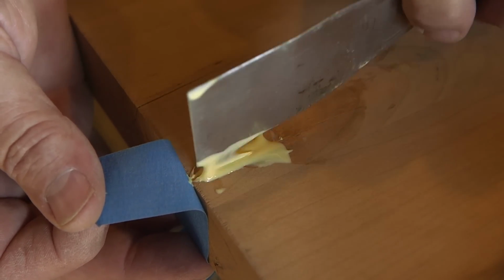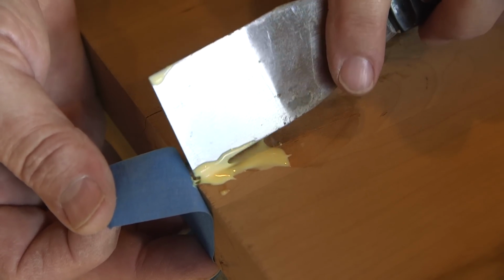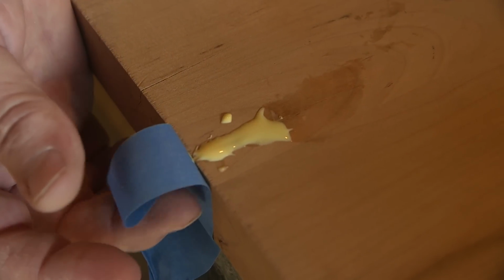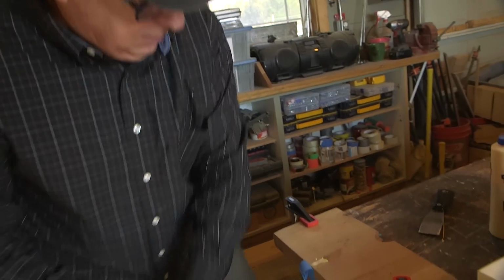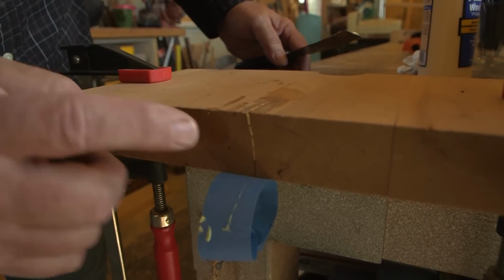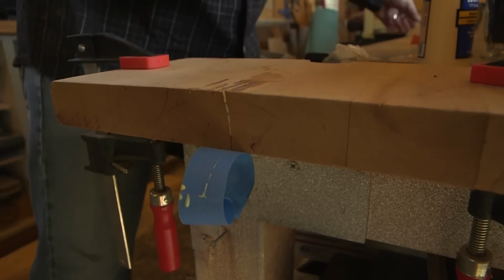And viscosity of the glue matters a lot. So this is actually an autumn day. The glue is a little cold. Room temperature glue is going to work better. But as you can see, look at it pulling it in, and we've simply affixed the vacuum to the bottom. Once you're satisfied that you've got enough glue into the joint, you can go ahead and shut off your vacuum and simply bead off the rest. And you can see that the glue is definitely down in the joint. Look at the end where it's pulled into the joint. A lot better than trying to push it down in there.